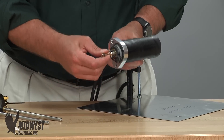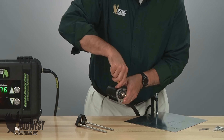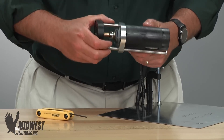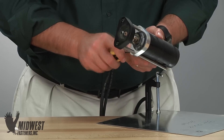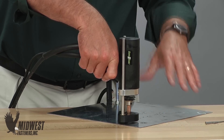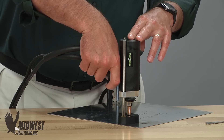The gun is prepared with the chucking accessory known as a collet for this type of fastener. Weld pins, properly sized and of the proper type, are held in the gun prior to welding by the collet. Likewise, the foot on the end of the gun is properly adjusted. The gun-mounted pin makes contact with the metal surface to be welded, the operator places the gun flat and flush onto the surface, and with pressure applied to remain rigid and stable, triggers the pin gun — completing the CD weld just that quickly.